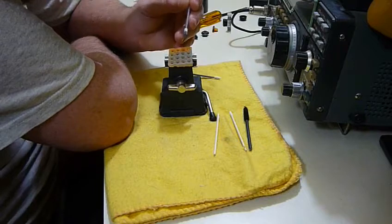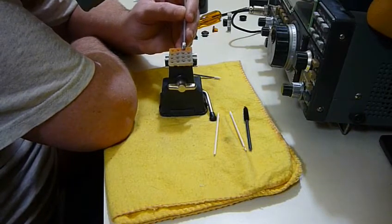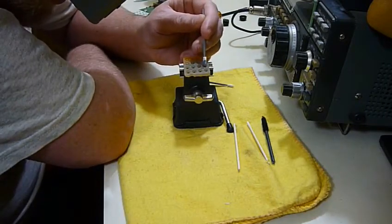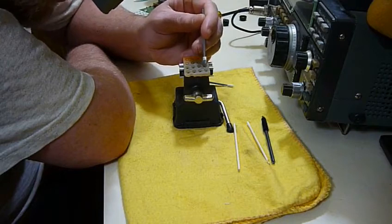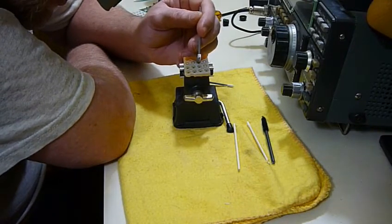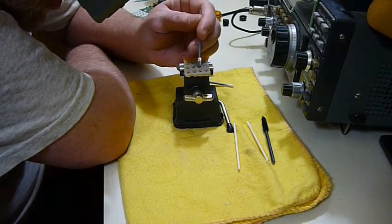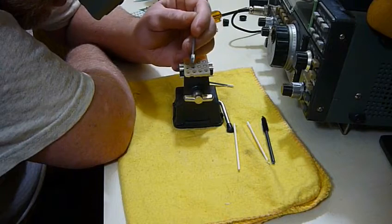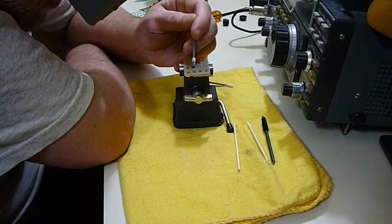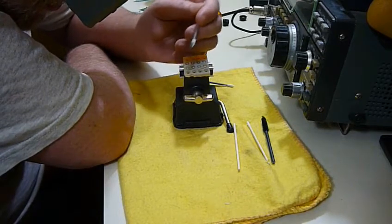You don't want to have the coffee shakes when you're doing this. There's two of them. That's looking just right. That's actually easier to do than I thought. You just blot it until you can't see no more black showing through. And you hope that it levels and slicks out enough when it dries to make a flat contact against those little gold pads on the circuit board.